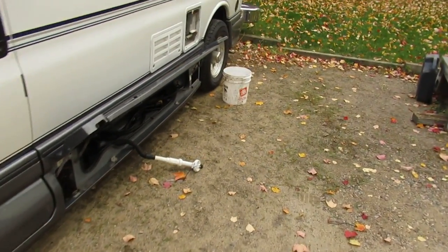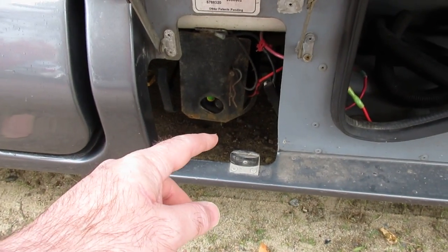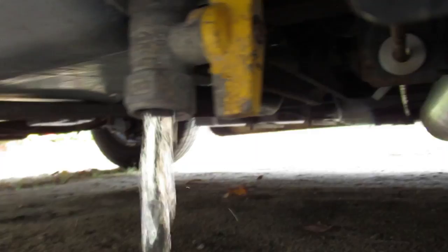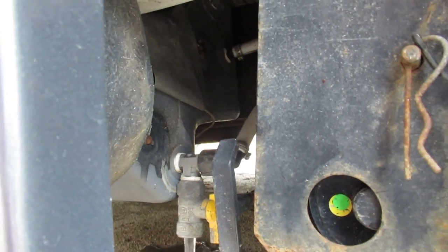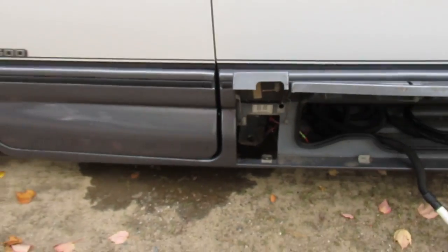If you open all the doors on the side here, you can see there's a sewer drain. There's a gray water tank on the left, black water on the right. There's also a valve here — see if I can get my paws on it. So this is how you drain your main tank. There's gonna be a lot of water in there; it's kind of time-consuming for that to drain. There's also an overflow in the system so when you fill up the tank to the max, it doesn't backfill out of the filler. That's the filler for the outdoor tank. Let that drain down.